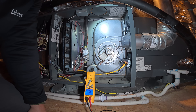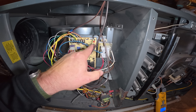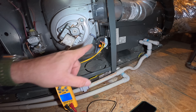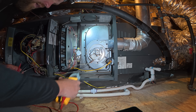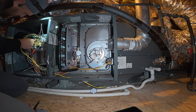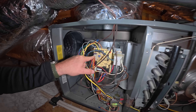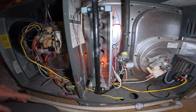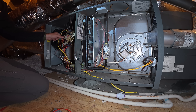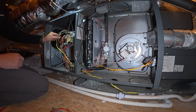Closed. It's odd that the inducer just randomly turned on. So we actually have a code of 123, and I just showed that switch was closed — so we need to see what's going on here. I just pushed in on this Molex plug and the code went away. Now it's about to fire up. I think that's our problem right there.